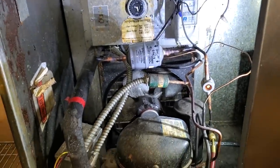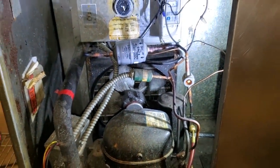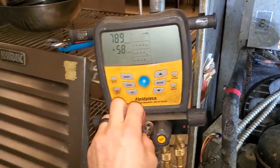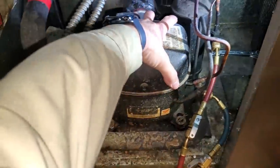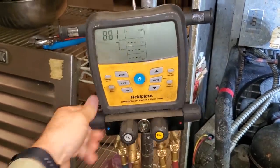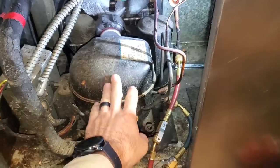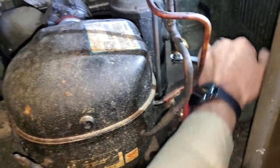While we're waiting for the evacuation — I already changed the liquid line filter dryer too, I swapped that out real quick. Once we get done and see somewhat of a satisfactory evacuation, we're going to open that king valve up and let the refrigerant through. I got a satisfactory evacuation — on my manifold with the low side open I'm at 893, but it's going to be much higher in the system. I'm going to go ahead and open up this king valve just a little bit, and then we're going to do a leak check on the system.